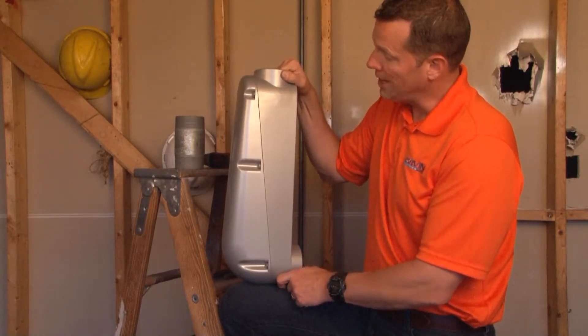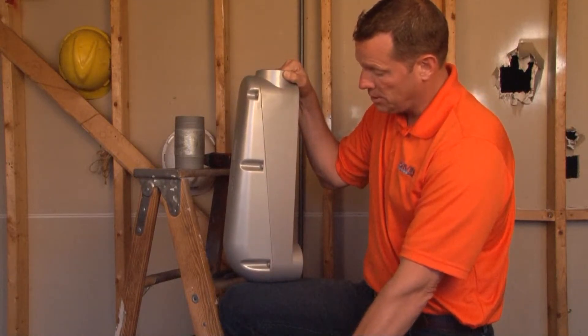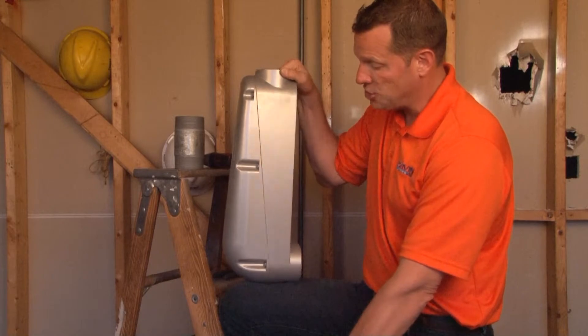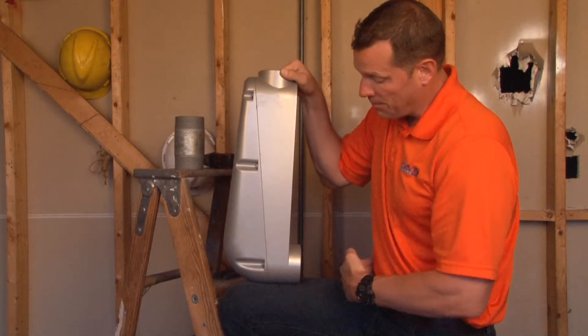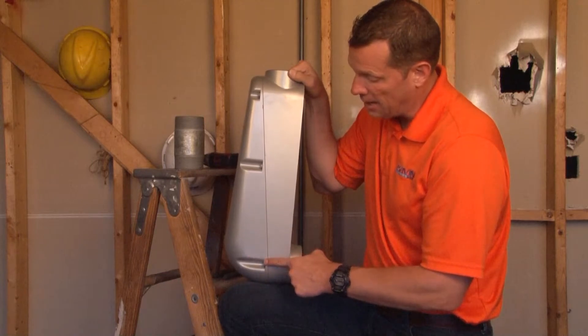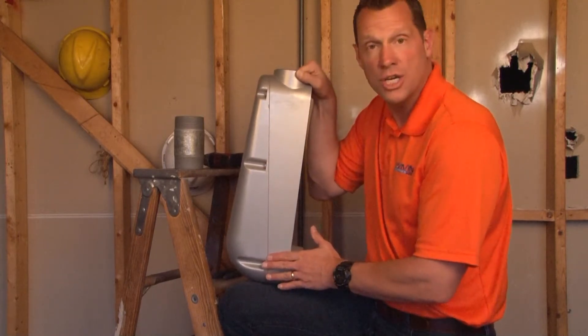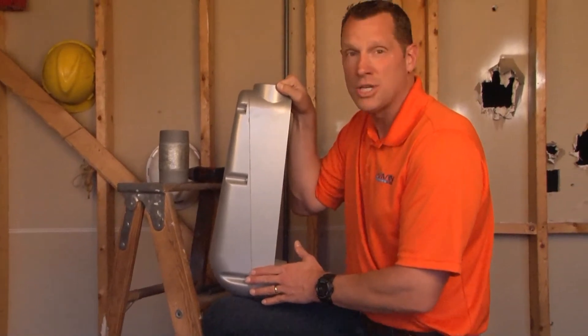At this point you're ready to pull wires. You pull them one direction until you get all the slack that you need and then you can feed them 90 degrees and not worry about getting too tight, because you have extra wire capacity due to the mogul cover shape. Makes wire pull simple and easy.